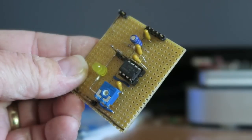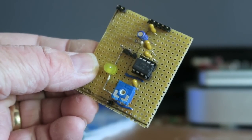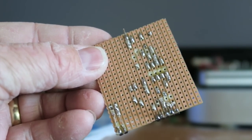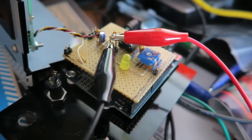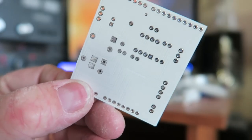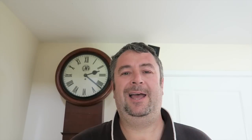From that version I created the Veroboard layout, which was very simple and straightforward — almost exactly the same as what I'd created on the breadboard. I created it in such a way that I could plug it straight onto the Arduino Uno with no problems at all, and it worked first time. The next logical progression was to create a PCB, and I used the Fritzing software. Within a week I had three boards back — and they were absolutely beautiful.